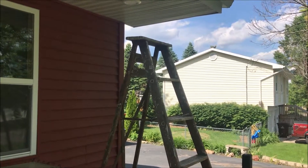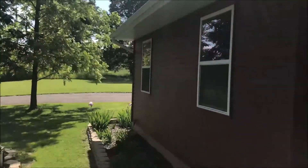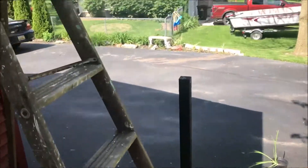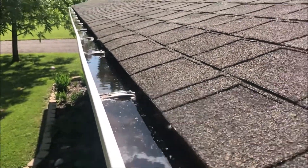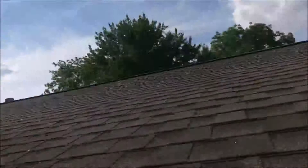Get a little closer down there. Let's see if we can get a good picture of it. I had some water leakage coming into my basement from outside, and I found it was coming in below this wall here. I have gutters and downspouts, but there was still water seeping into my basement. So I've come up here with my ladder to check and make sure there are no leaves blocking. As I look down here — holy cow — this whole thing is full of water. So as the rain comes off my shingles, it's going straight off the edge, and that's where I'm getting my water in the basement.